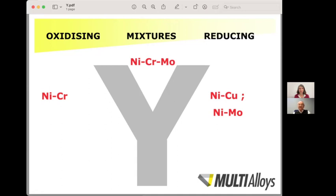Just a point to note, when it comes to nickel alloys, we know most of them by their trade names. So, for example, people might know about Inconel, but that's the trade name of one manufacturer. And of course, there are others that also produce the material. Similarly, Inconel covers quite a number of different grades of metal. We could also refer to it by a UNS number, like UNS N06600, but then I think we'd lose each other. So we've chosen to refer to it in this talk, and generally speaking, in general terms, as alloy 600 or alloy G35, etc.